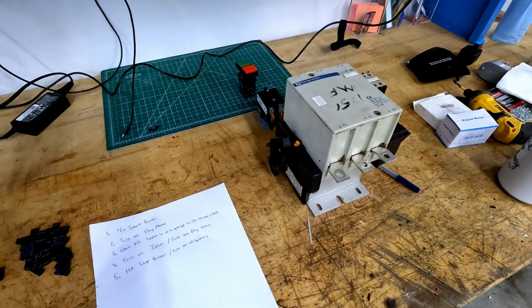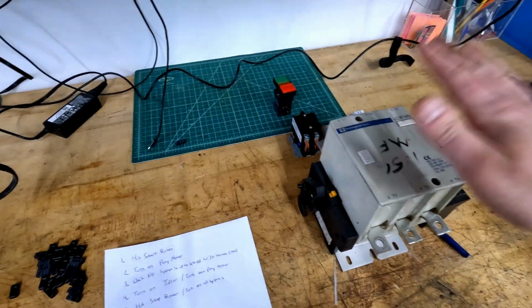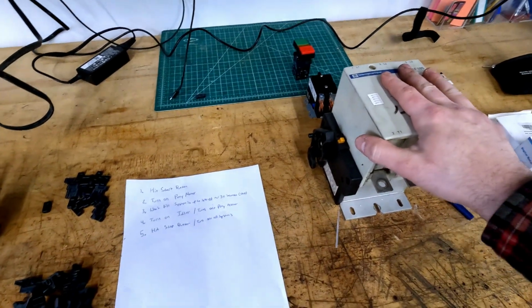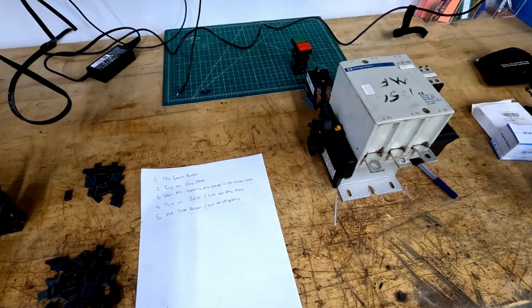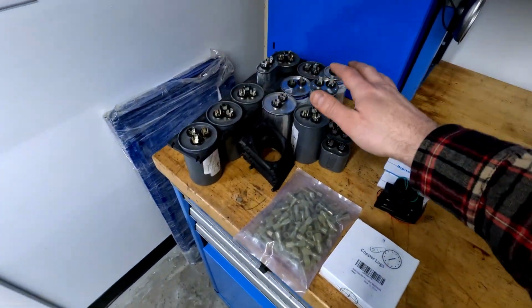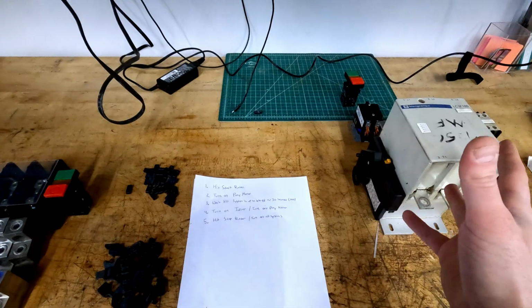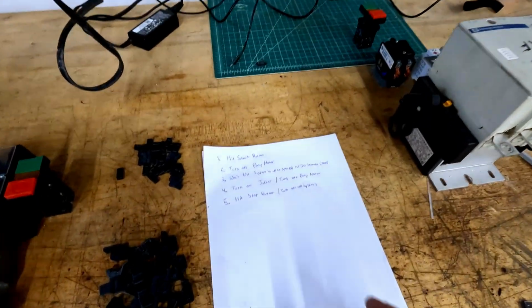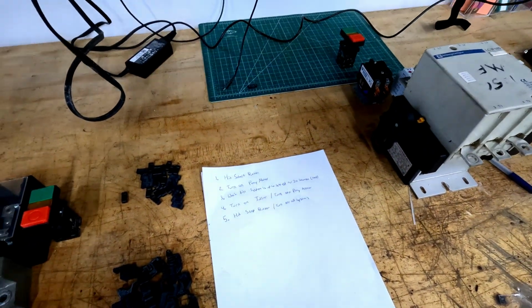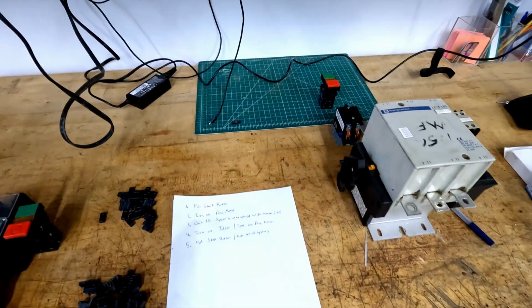Assuming that everything went correctly, we'll end up with our pony motor stopped, our main idler motor running, and a working 3-phase system. We will of course have to do some phase balancing using our capacitor array, which we'll get to later, and we're going to monitor that using our digital meters, but really that's the entire system. The last step in the system is going to be hitting the off button and having the entire system shut down.